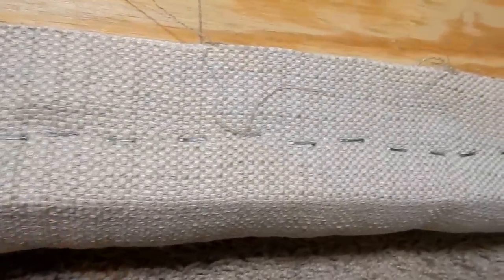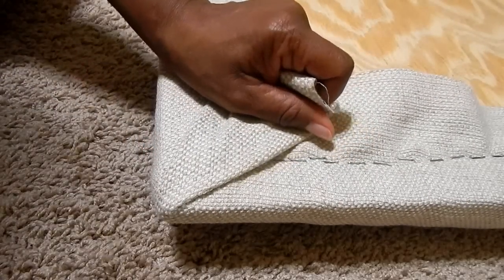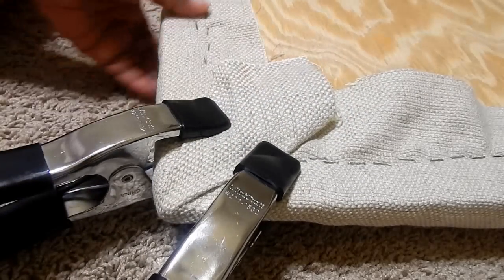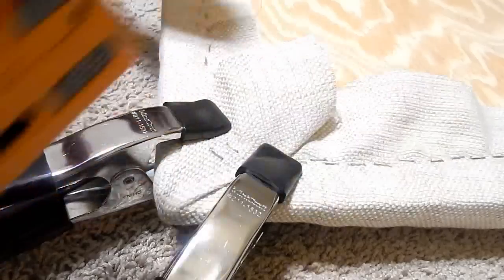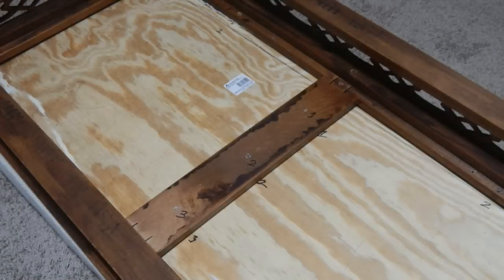I always start in the center of the fabric when stapling. I staple one complete side — but not the corners — then go to the opposite side to stretch the fabric while stapling. For corners, staple about one inch away from the corner to keep it clean. Then pull what I call 'bunny ears' — that little flap underneath — make the bunny ear, place some clamps to hold it, and staple. See how nice and smooth that corner is? No bunched-up fabric. Staple and remove the clamps.